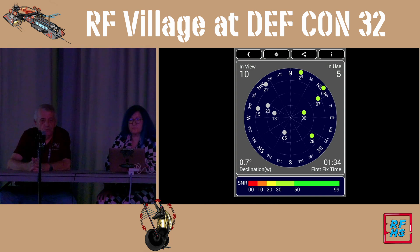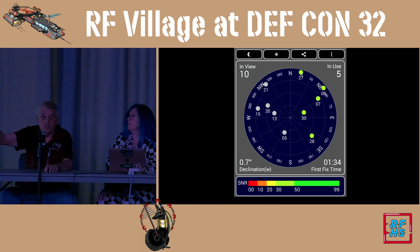Now we'll get a little bit into spoofing. Spoofing is a bit more complex. The normal procedure is you're going to pretend to be a GPS satellite and send out a signal pretending to be GPS. You can do this with two signals, but you really need to use three, and the signals are incredibly complex. To generate three on one transmitter can be done — it's being done — but it is not simplistic. I recently saw a demonstration where they had a drone fly through a three-dimensional maze, and all the time the drone thought it was in a stable hover.